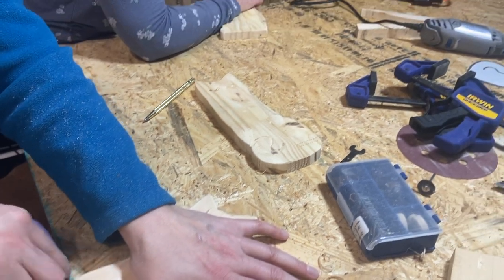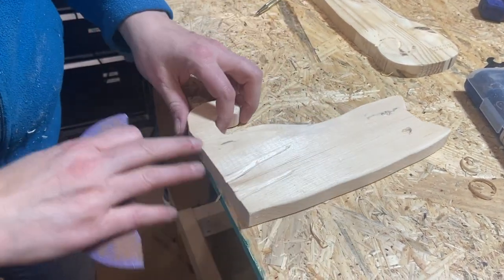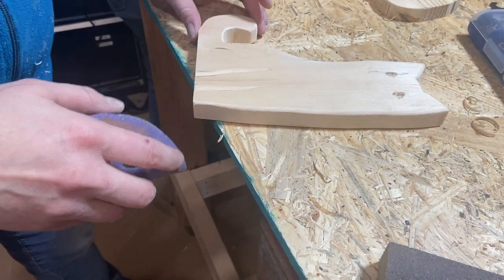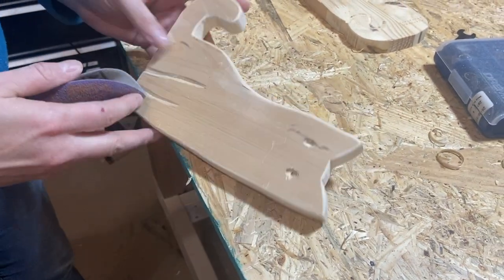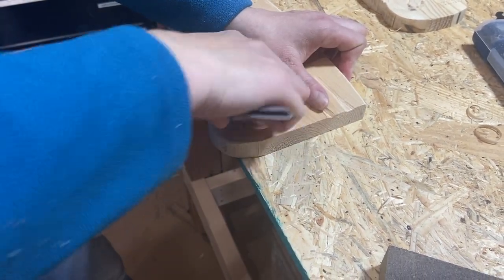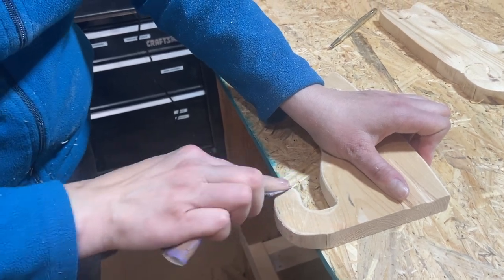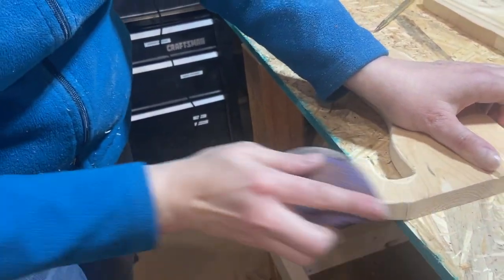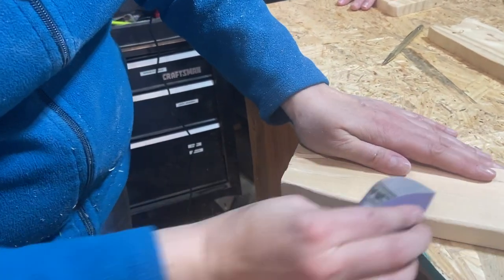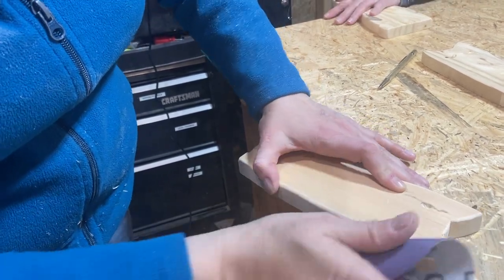Lots and lots and lots of sanding. So what we're doing is smoothing this out, rounding off the edges, leaving the bottoms flat so they'll be able to stand up, but this is giving it a little bit more of an organic shape instead of just a flat edge. Right now I'm using a pretty rough sandpaper — this is a 60 grit in order to get the rounding off I want, to take off as much material, and then I'll finish it up with a finer sandpaper. This is an instance where there is actually no real good power tool for this. A lot of this is just by feel, as you can tell.